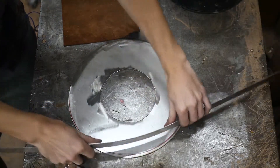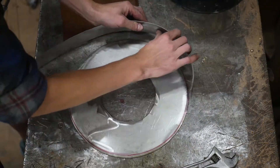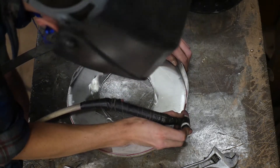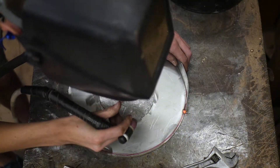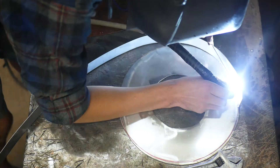In some hobby setups, low-oxygen furnaces burn more like a campfire instead of a raging jet engine. If you have a campfire-like flame then you're lacking enough oxygen to mix with the propane — it's a significantly cooler burn and sort of dangerous because there's a lot of unburnt propane floating around. You want a very vigorous flame.